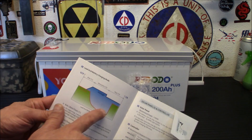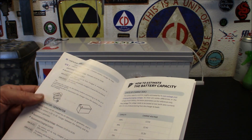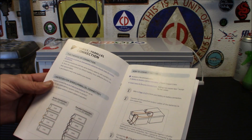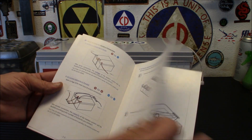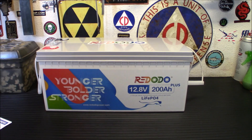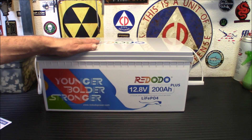That's probably the most important information when setting up your charge controller. The manual also explains absorption rate, float charges, how to estimate battery capacity, how to connect in series or parallel, and how to connect to a bus bar. It's an excellent, very well-done manual. The charge controller I'm going to use is the same type I used on the 100 amp hour rolling system I made a few days ago. Right now I have a cheap PWM controller over there for the single lead acid battery, but you can't adjust the parameters on it for LiFePO4, so we're going to be using a different, compatible charge controller.